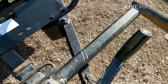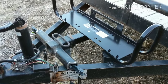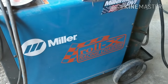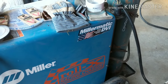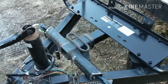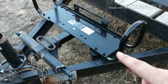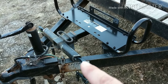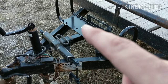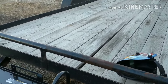I'm back, got that cut off and got it clamped on there. I'm gonna take my welder — nice Miller DVI dual voltage — and weld this on here so I'll be able to pull that part out of the receiver. I'm just gonna weld it here and over here, and then this piece here I'm gonna mount the winch on and it will go to the back.